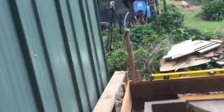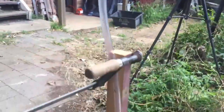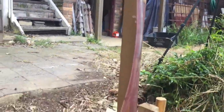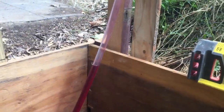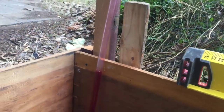So I'll show you how I've got this one going. You can see that at this end I've got a plastic tube and I've got it just staked up, and there's where the water level is in this at the moment. So you basically just get it so that you've got it against one side of your slab, and you can just run along the ground however you want.